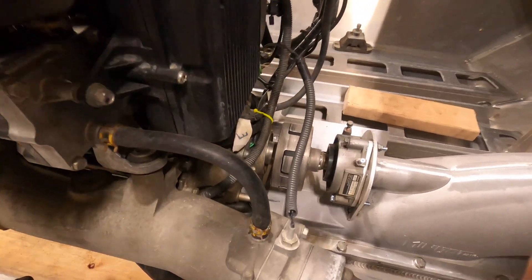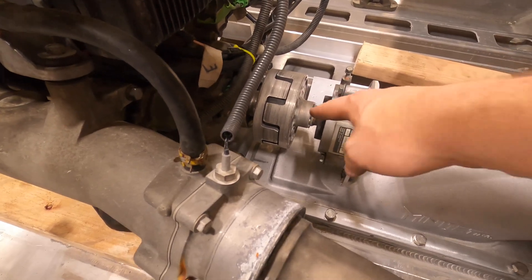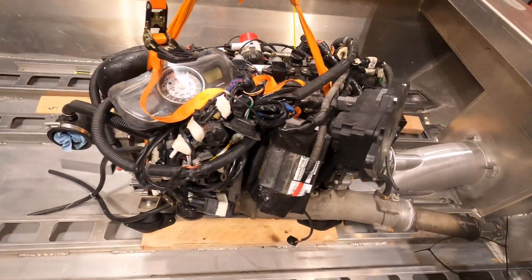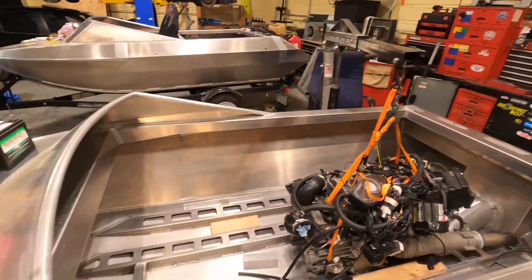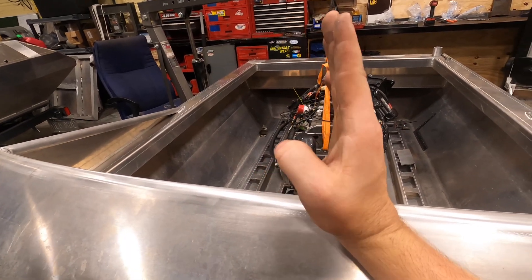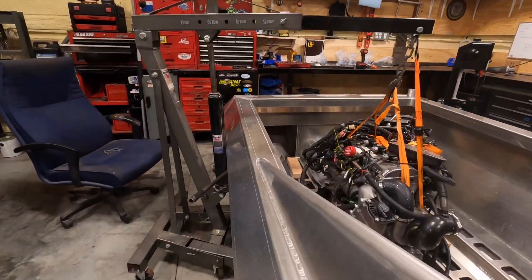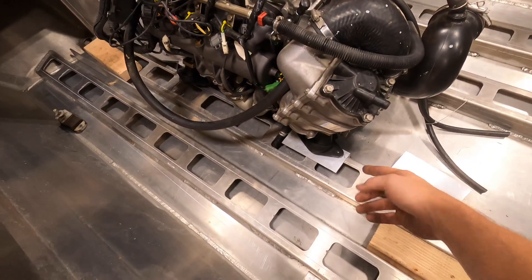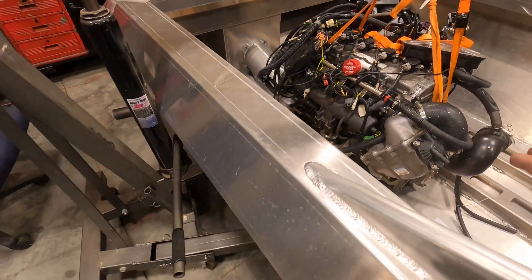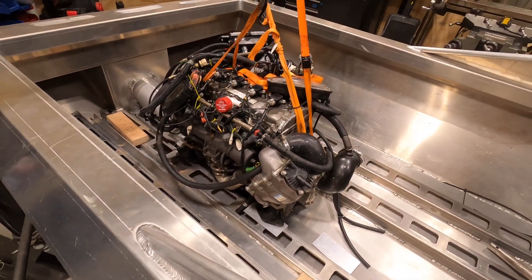I have my four motor mounts now. I just need to get these located about an inch and a half up off of the stringer, and then set the motor down and verify its location. The motor is where it needs to be — I've tested all the way around the circumference of the pump shaft adapter and that spacing is the same all the way throughout, at 3.30. The motor is cocked off to a small amount to the left, but that won't affect oiling or anything. Now I just have to get these little tabs elevated, clamped on, tacked into place, do that for both front and back, then lift the motor up, fully weld those, and repeat for the other side.